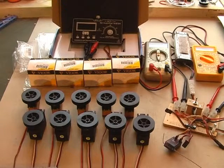A visual inspection found one of the servos from each batch had a bottom seal misplaced. The seal of the VSD-10Y was hanging out. The seal of the VSD-22YMB gold showed up a design fault — it is impossible for the assembly operative to position the seal correctly around the motor area. The motor could be seen from the outside through the casing joint.